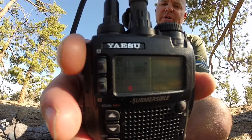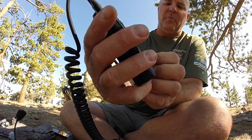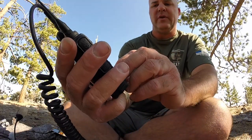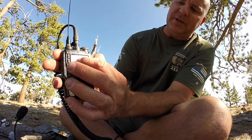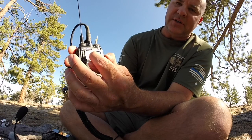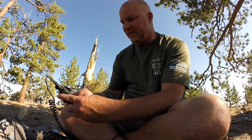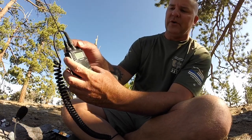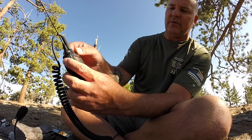Now to toggle back, you can see that little arrow above the 'A' that tells me which field I'm on right now. I can change that — just push Mode and you'll see that arrow moves. After about three presses, now there's a bunch of dots right down here in your message box; that first dot is actually blinking and that's telling you where you're at in your message. So now all I've got to put in is the actual summit peak I'm on — in this case I'm going to use the alphanumeric keypad. It's Whiskey Six, and then if you hit zero you get the slash marks. Whiskey Six stroke once I find the right stroke.